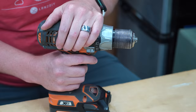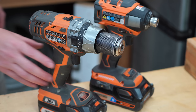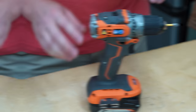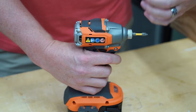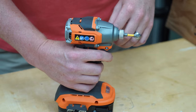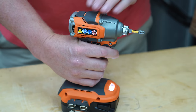These drills are awesome, they have all kinds of functions and capabilities, but more and more, with newer and better bits coming out as well as the types of DIY projects I'm working on, I find myself reaching for my impact driver so much more — and I don't just use it for driving, but also for drilling. An impact driver uses a hammering function, or a twisting and impact function, to not only drive fasteners in, but it slams a little metal disc against the drive shaft in the same direction you're driving the screw.